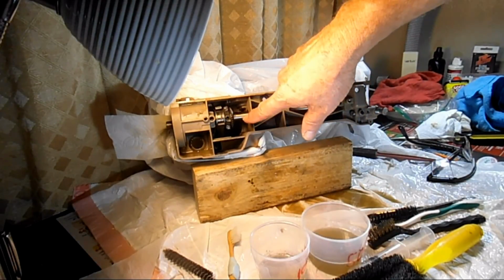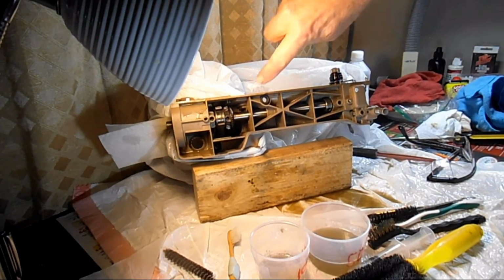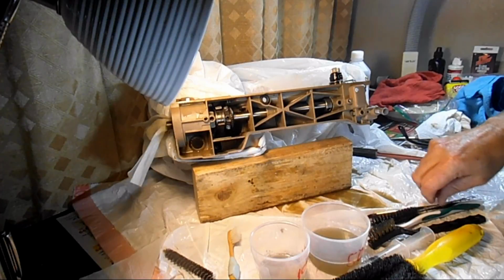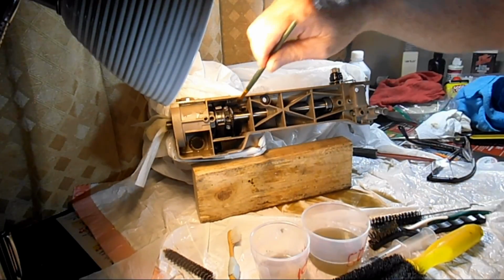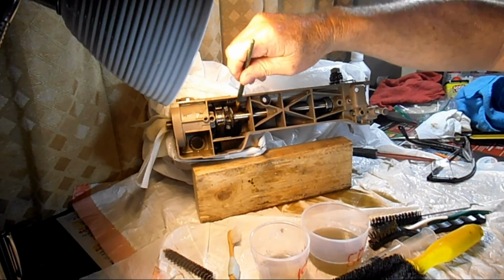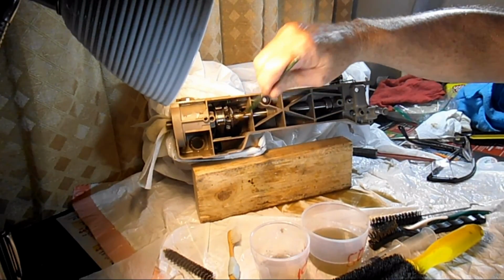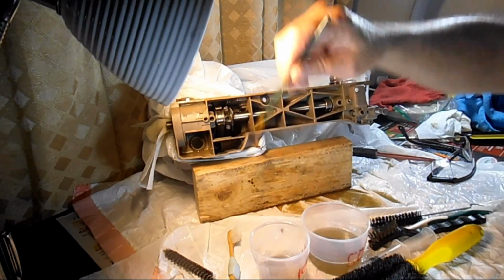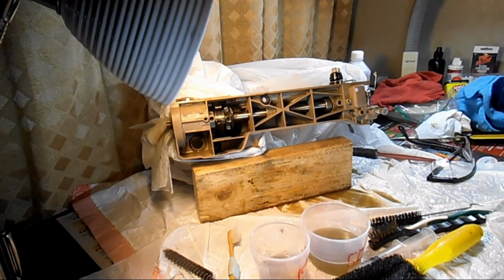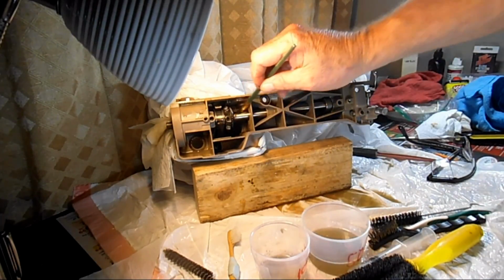Oh, that's pretty good. So you have gears over here that are reverse of what are on the bottom, and the top of the vertical shaft down here has a horizontal gear that's tricky to get clean. So I definitely like to pre-treat the top of these shafts and the gears here with 100% and get the old stuff starting to soften up. And let's see if I can turn those gears about 90 degrees and get some more, especially on that darn bottom gear there.